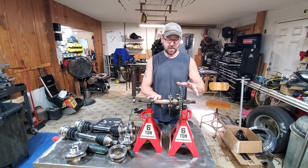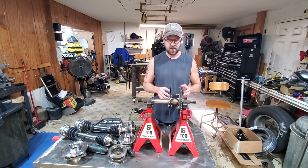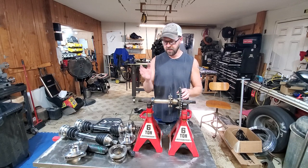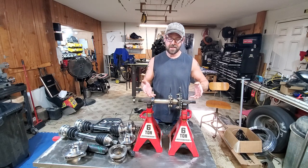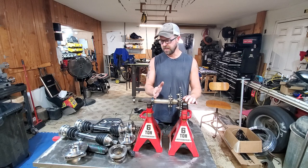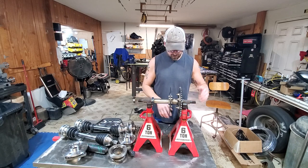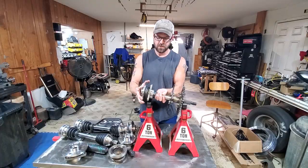The first thing I did was figure out how I was going to make this axle removable so that I could get my sprocket off and replace it if I need to, or change the number of teeth on the sprocket, and be able to put a new rotor on if needed. I decided to use some old CV axles, just cut the ends off to get the spline, and then turn that down on the lathe so everything would fit properly. That fits up to a hub which is completely removable.